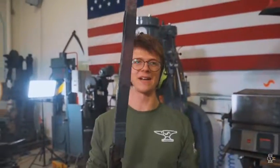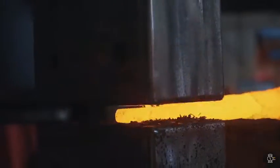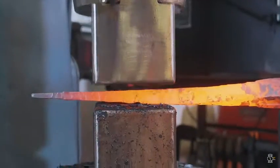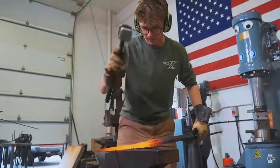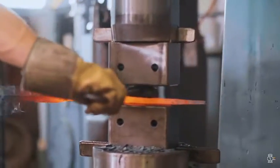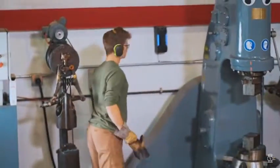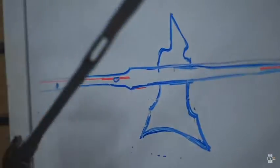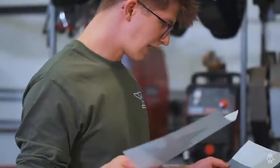Next step is for us to forge the taper of the point and for us to then flip it around and start working on our tang area. A beak forged out, a little pointy bit right at the tip. We have a hole. We just need to find our solution for how this is going to mount to a handle.